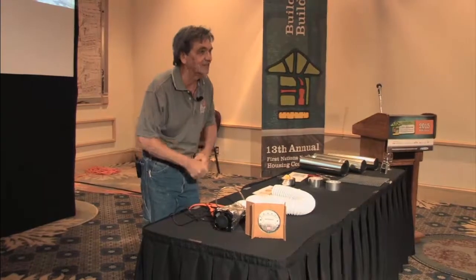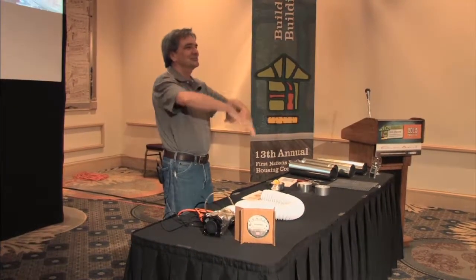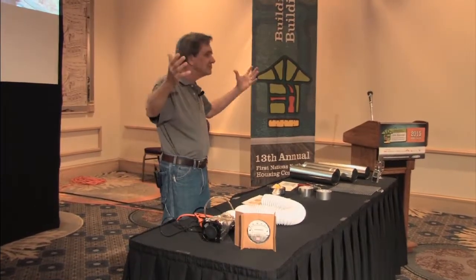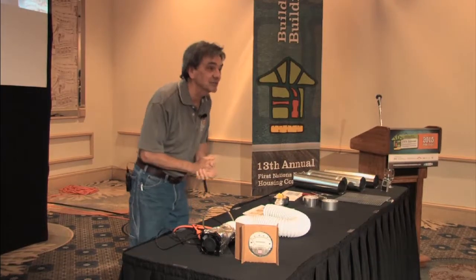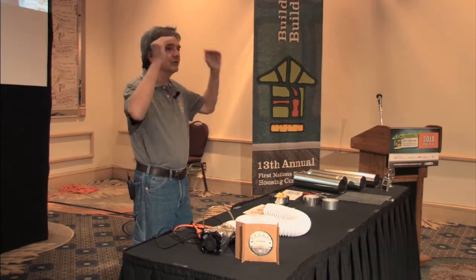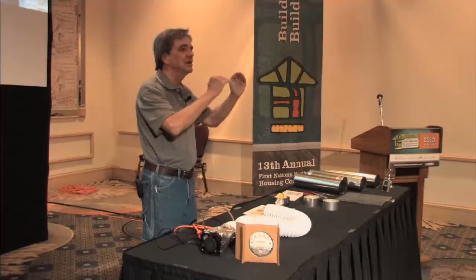When you just make a sauna and you have relatively mediocre insulation in the walls and the ceiling, you're going to get cold surfaces. And when you get cold surfaces and high humidity, you get condensation. And condensation that stays gives you mold. That's the whole theory course.